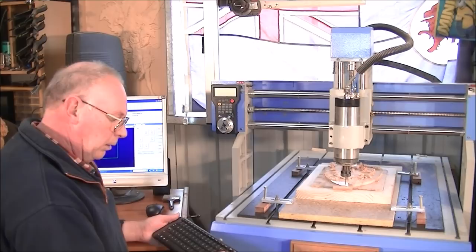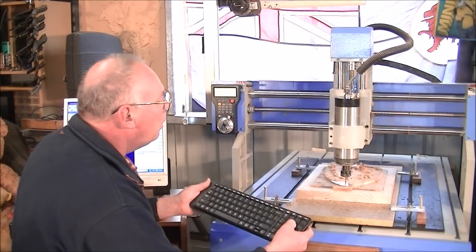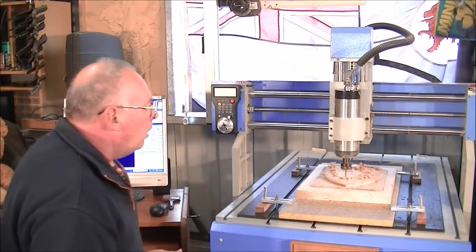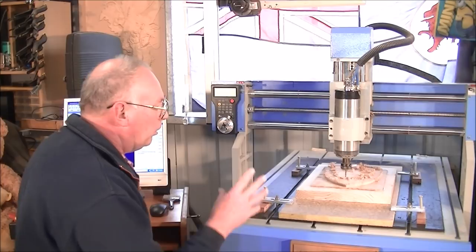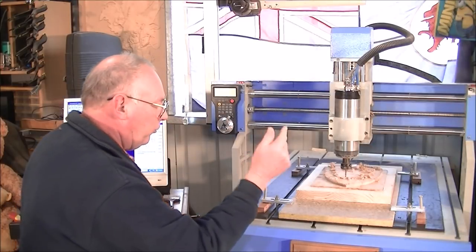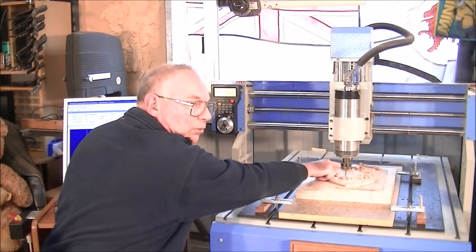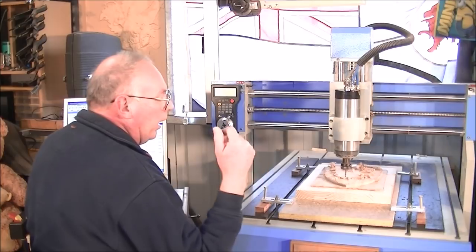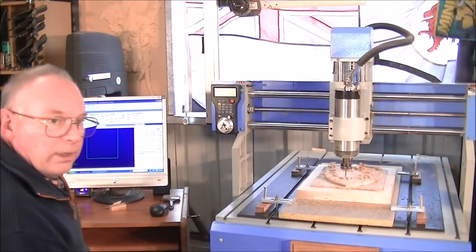So now I think, if I alter the jog setting to full-time jog, lift the tool up to a safe distance, remove that, I'll show you, because the computer knows exactly where this head is now, so I could actually start the program up right here, and it will travel back to the zero position, register that zero position, then come to the front here, come down quietly, and come back and forth, and start to machine the finishing tool path. So we'll do that right now.